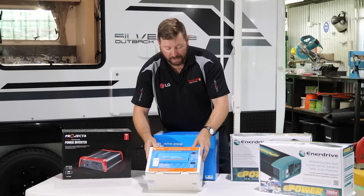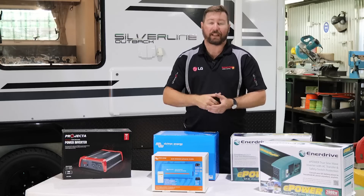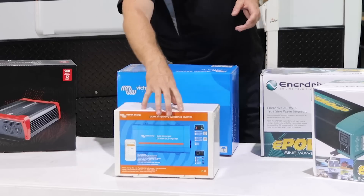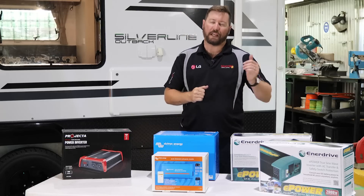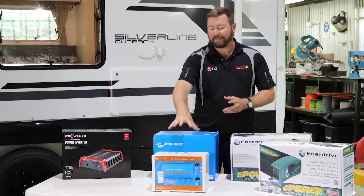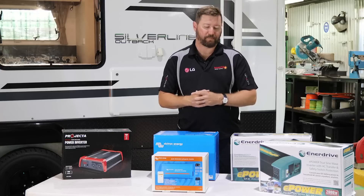This little unit here is a 350 watt, 12 volt inverter, so it connects directly to our battery. Cable size is critical for all inverters — the bigger the inverter, the larger the cable we need to install. For this little inverter, keep it nice and close to the battery: 6 mil square cable or 10 mil square cable depending on distance. We connect it to our battery and we can plug in our appliances onto the inverter itself. If we had lots of small appliances, we'd plug in a small power board and run multiple devices — might recharge a laptop, recharge our mobile phone, run a small DVD player.